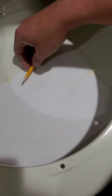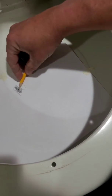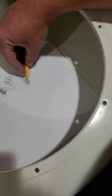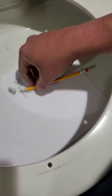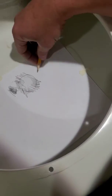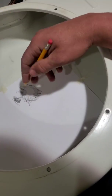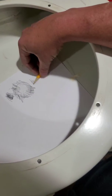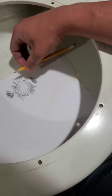I taped a piece of paper on the inside just to orient the holes, and I will rotate it 90 degrees and drill the new holes, mount it, and have the shroud point in the direction I want. The old holes I'll just put duct tape over — it ain't gonna hurt anything. This will get me out of a bind; I have clearance issues with it near my garage door, so this will help tremendously.